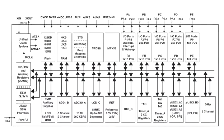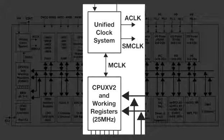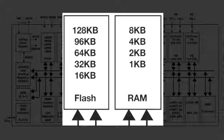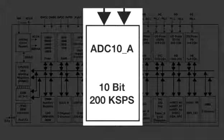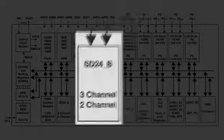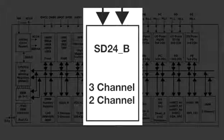Let's take a closer look at the features inside the MSP430 F6736. At the core of this device is a 16-bit RISC architecture CPU with a system frequency of 25 MHz. There's up to 128 Kbytes of flash and 8 Kbytes of RAM. The feature-rich analog peripherals include a 10-bit SAR A2D, power management module with two auxiliary supplies, and up to three 24-bit Sigma Delta converters. Each Sigma Delta channel is designed with a fully differential analog input pair and programmable gain amplifier input stage.